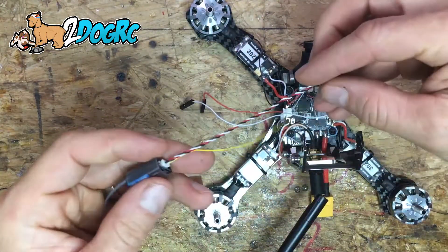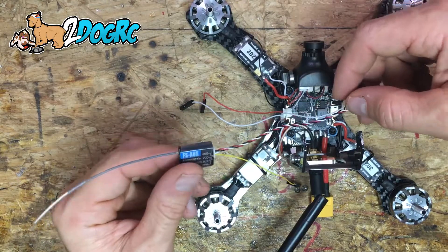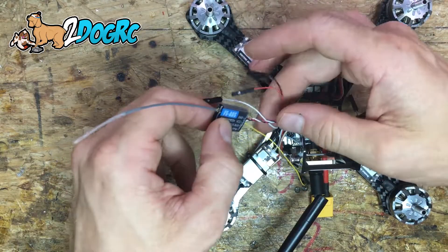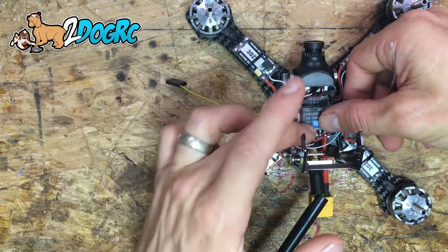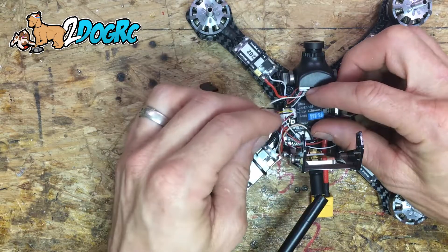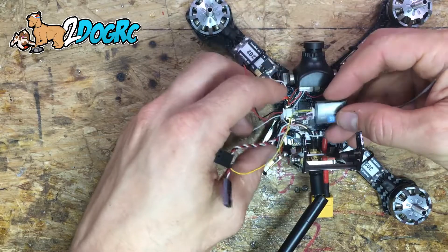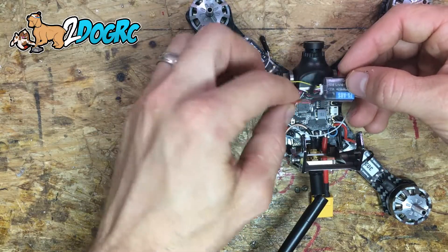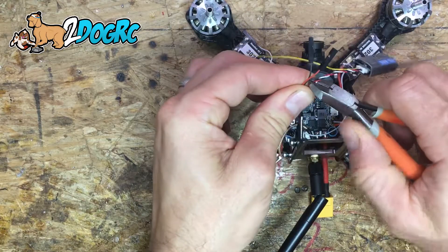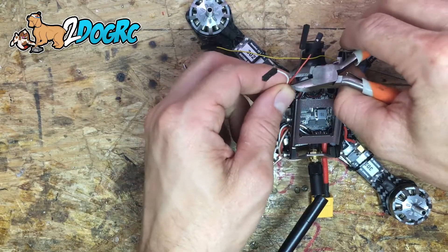What we're gonna have to do is connect these two — you've got a servo wire and you've got these pins, so you're gonna have to do a little bit of soldering, but this is level one soldering so it won't be too bad. I'm going to cut these wires, solder them together, and stick the receiver right in there. I'll run the antenna wire out this back arm. You can see how much wire you need — you don't need much. So this is going to go about this long, leaving a little extra.